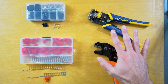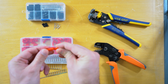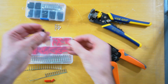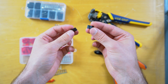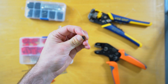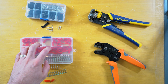This is the hardware and these are the tools that you're going to be using to complete this process. These are your JST connectors and they vary just very slightly from the Dupont — there's a mechanism that allows them to be plugged into each other. Female ends will go in here and then the male ends will go in here. These are your Dupont ones and the difference is that there's no definitive female and male differentiation from the two different parts. When you finish these, the male ends will actually be coming out of the plastic piece and then the female ends will just be on the inside of the Dupont and you just plug them straight in. The JST connectors are used for your BL Touch and the Dupont ones are used for basically everything else.